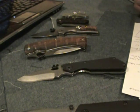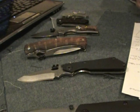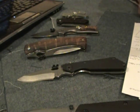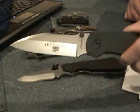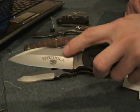S30V compared to 154CM has maybe three times as much possibility of corroding. With 154CM, you're trading some edge retention and a little toughness, but you get the ability to dry-lubricate, some tool steel heat resistance when cutting heavy-duty material, and you don't have to worry as much about the steel affecting the structure of the blade.